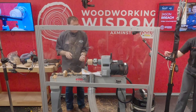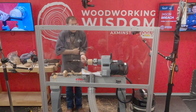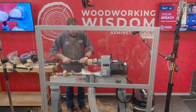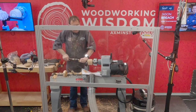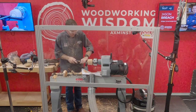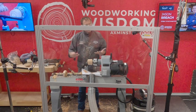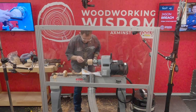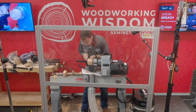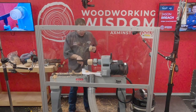Most people grip with an overhand grip — this locks everything up. My elbow presses into the side of my body. But the underhand grip gives you more room — you're in line with what you're trying to cut and you can see it better. We've got a nice hard corner now. I've got fluff in the back edge, so a skew chisel — the point will get in there easier.